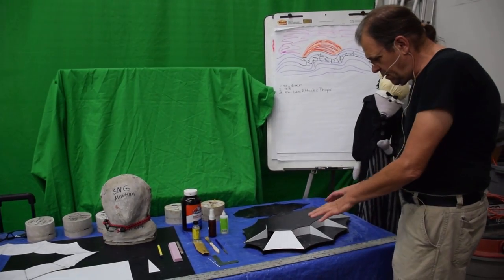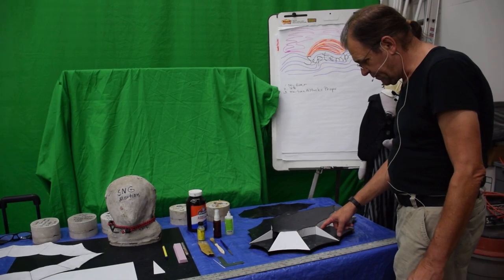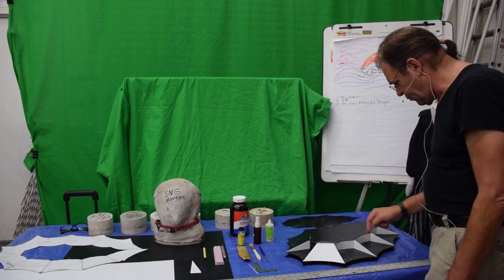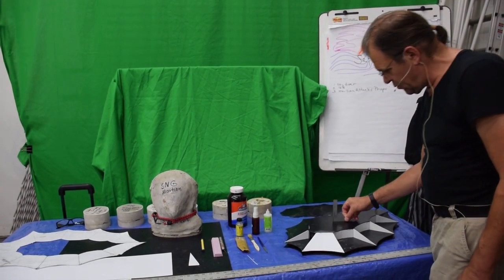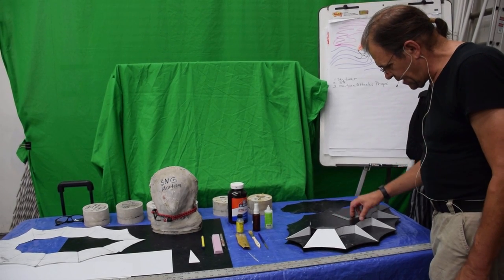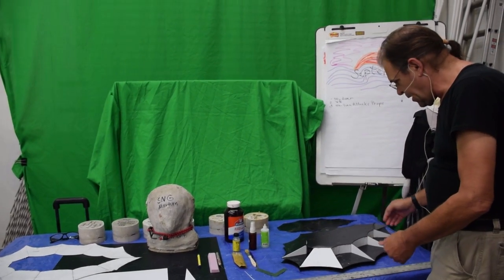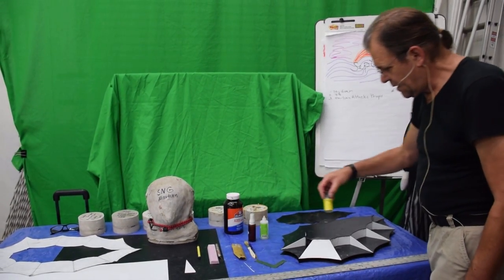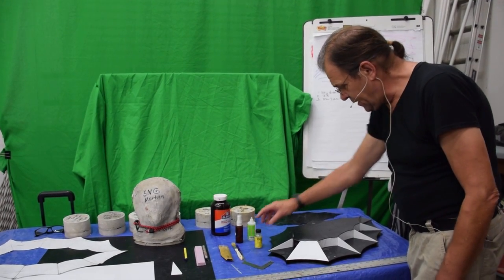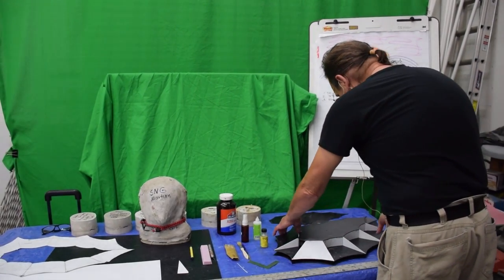And then I went in here, and because I had this open hole here, I cut a 1.5 inch strip of styrene, and I ran it along this way, and I marked where the bends were, and I used this X-Acto tool to make a nice straight cut, and just snapped it, and they stay connected, and you can just bend them right in. And then I used, of course, the styrene glue, which works very quickly, as fast as CA. I was able to hold the stuff right in there and do that all the way around, as you can see.